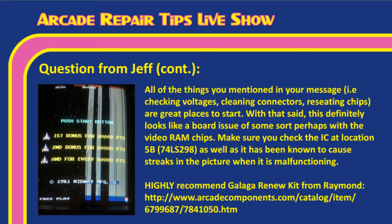That's really what lends it more to a board issue versus a monitor issue of some sort. Exactly. When you look at the little details, Tim, you can start to see where the issues are. If it was a monitor issue, those areas would be blank. It'd be consistent all the way down. You wouldn't have cutouts for text or anything like that. You'd see that streaking happen on every element of the monitor. And so that's what it really comes down to.